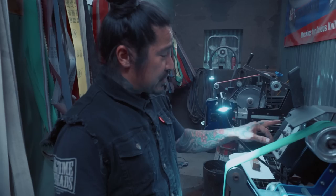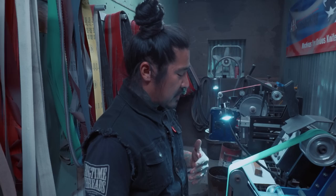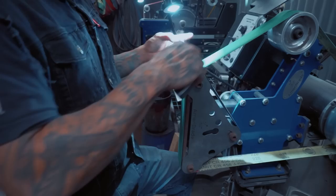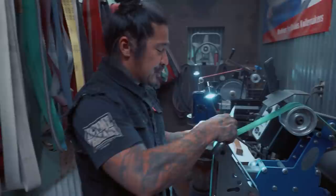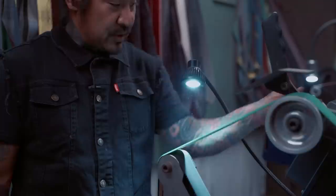The machine goes backwards and forwards. I like using the hard platen to start sharpening first, because the flexible wheel section can put a whoop in your blade. Once I feel an edge breaking, I switch up to the wheel. If you're removing material where it's thick and thin, thick and thin, you'll get that whoop. I run this machine backwards.